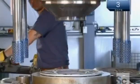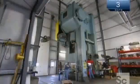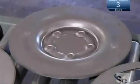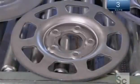The rings give the windows a nicer look, and the coining action compresses the steel to further strengthen the part. The next press is critical — it forces the disc into a bowl shape and gives it precise dimensions to accommodate brakes. The specific angles also reinforce the part. The center disc of this racing wheel has really taken shape.